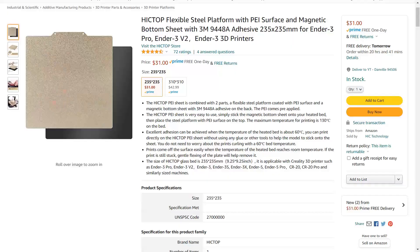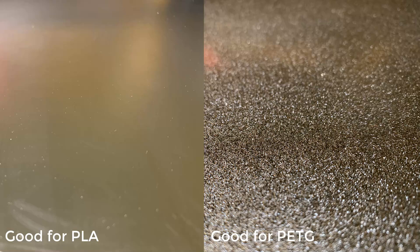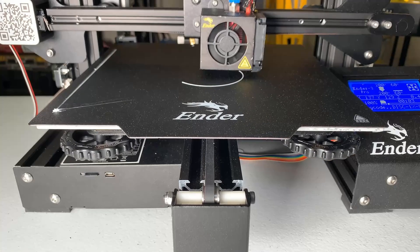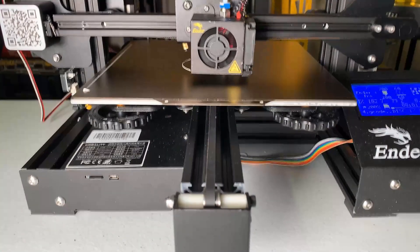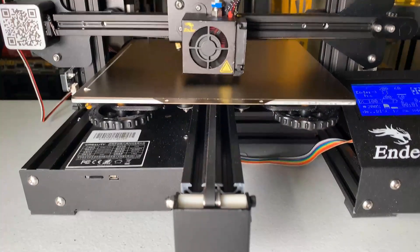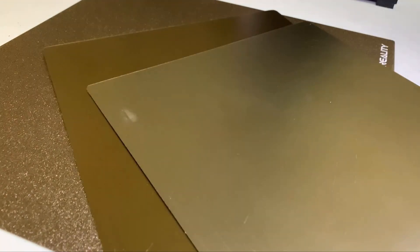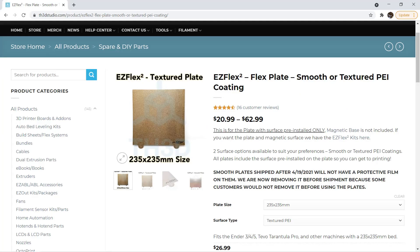These are the items I'm going to add. First, a Spring Steel Sheet print surface. I have another one with a double-sided surface — the back is coated with powder, which doesn't stick as well as the PEI sheet when printing PLA, but it's more suitable for PETG. With the stock magnetic surface I had to print at 25-30mm per second for the first layer, but on the PEI surface I can print at 50mm per second without any problems. You also get the same flat surface at the bottom of your print. There are quite a few brands, but I can't see noticeable differences between them. A double-sided spring steel sheet costs $35, and a single-sided sheet costs $5-10 less.